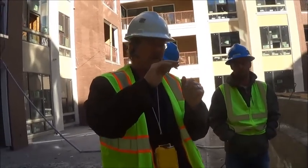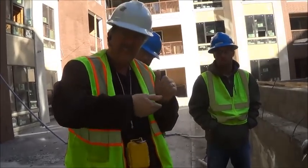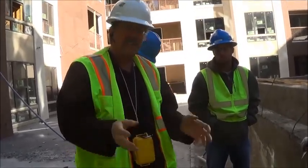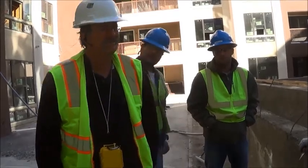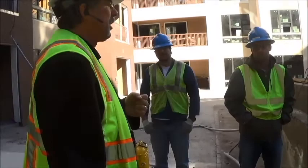Solvent wipe it, right? Yeah, and then take the epoxy on the 250. But always remember, run the epoxy down onto the concrete. So you stop the lip edge of the 250 and sand it, and you won't have any issues with that. Electrical conduits, plumbing.